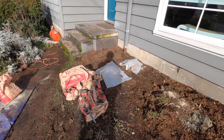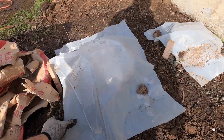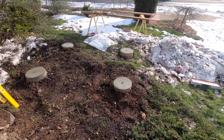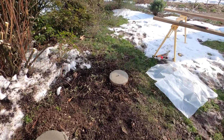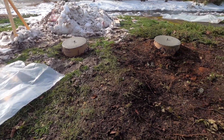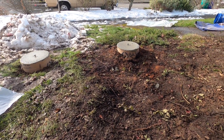Earlier in the day I got these two poured. Had them covered up because there was a little bit of rain, but those are pretty much set. I'm going to put plastic on these — I just got all four poured. This is probably the wettest one, but these are setting up nice. I like having the nut on there because sometimes you need to pound it just a little bit with the hammer. These are going to set all night, and I'll start putting on my beams tomorrow.